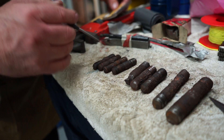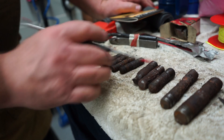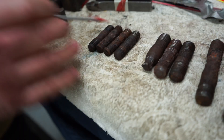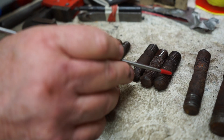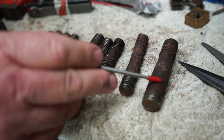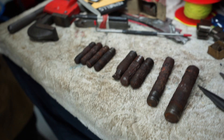So over here today we've got, this is what I need to machine or thread today with the Coventry die head. We've got some studs — these are all studs out of a vintage engine. We've got some half-inch studs. I believe they're five-eighths of an inch studs. I think that one is too. This one's three-quarter of an inch. So I've got my work cut out but this Coventry die head's really working well.